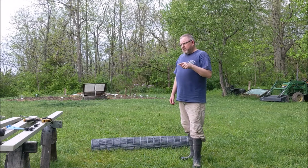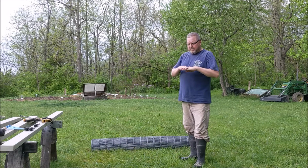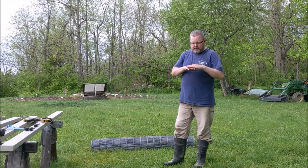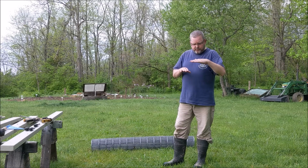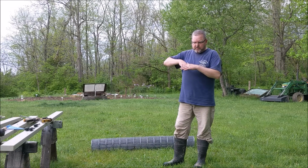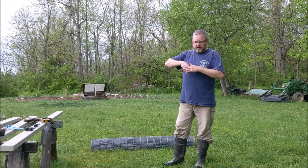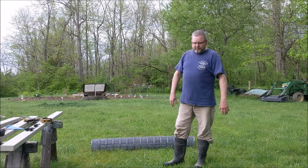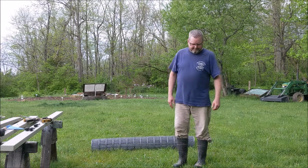And then we're going to do a lap joint, where I take half of the cross 2x4 off, and then the up and down 2x4, we'll take half of that off, and we'll put those boards together and throw some wood screws in. And that I will be doing mainly with power tools. So we're going to do one with mostly hand tools and the other one mostly power tools. So let's get this project done.